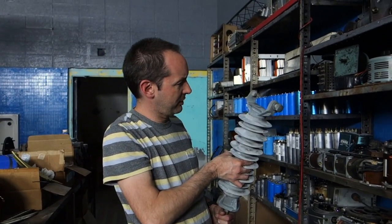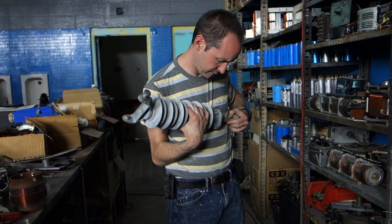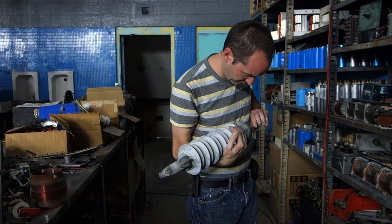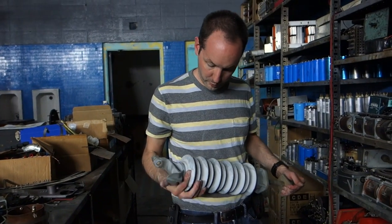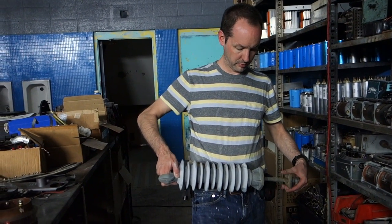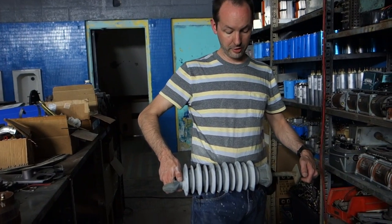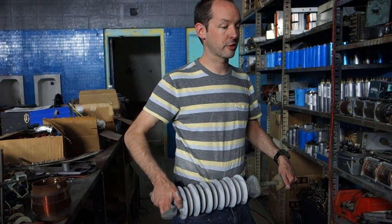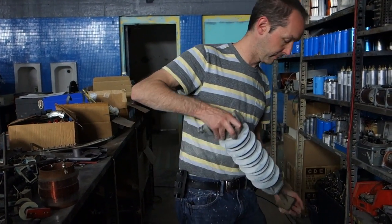It says it was made in '99 by SED. 3/4 inch. 14R. 11X45F. This probably out in the real world, 40 kilovolts or so, maybe a little more. Somewhere around 40, 50, I guess. In here, this would easily withstand 100 kilovolts. No problem, if you clean it up good. It's dusty and schmooky, but this would take 100 kilovolts in here. So you could use this with the fulgurites and with the lifter. This would work really well as a lifter.